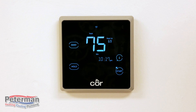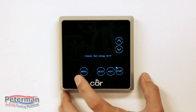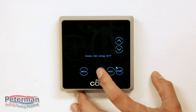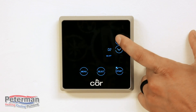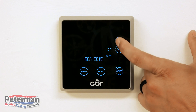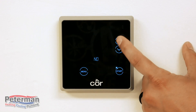To connect your Core 7 thermostat to Wi-Fi, hit the Start button to activate your screen, then go to Menu. Your schedule will be blinking — hit Next until you see Wi-Fi blinking, then select it. From here go up and enable updates on the thermostat. We want to check for updates — select and say yes.